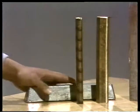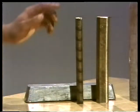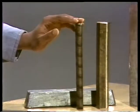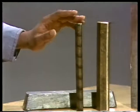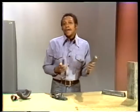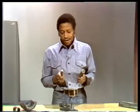There are two other alloys commonly used to make bearings: bronze and brass. Bronze is a combination of copper and tin; brass is a combination of copper and zinc. Either of these alloys has a greater degree of strength than babbitt. However, they don't have all of the other properties to the same degree — they're low in conformability, embeddability, and seizure resistance. But when strength is the most important characteristic, either bronze or brass could be used.